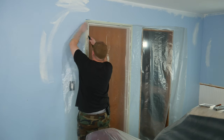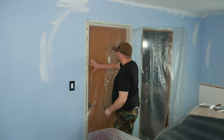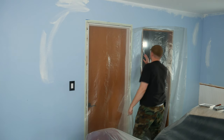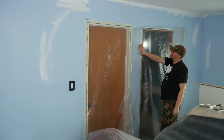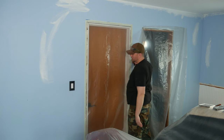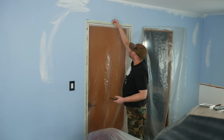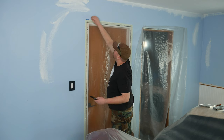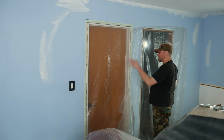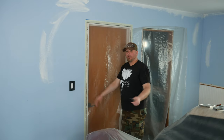This would go a lot better with a utility knife handy, but since this knife isn't very sharp I'm not trying to tape it off perfectly anyway. This is more or less just to keep paint from splattering onto the door and onto the nice oak finish trim that I don't want to get paint on. I've got it nicely tarped off now. And here's a perfect example of what I was talking about — some old masking tape from who knows how long ago, all hardened and crusty. I'll have to scrape that off. Just make sure your line is inside of where the trim goes and you're good to go.